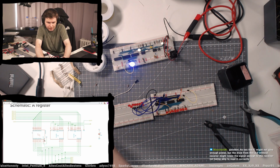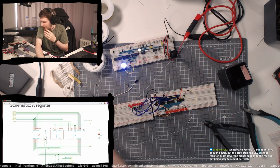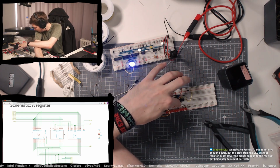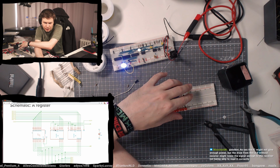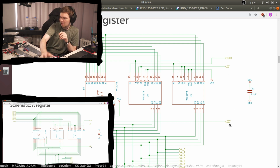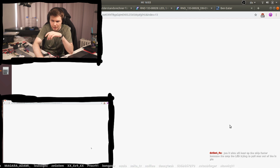Okay, so yeah, pin 19 was put to VCC. That's correct. And down here we connected 1, 2, 3, 4, 5, 6, 7, 8. We connected pin 9. Where's pin 9? Connected 9 is the A1. What is that? Oh, in or out. Okay, I think I feel kind of confident to almost plug this in. What else do we need?